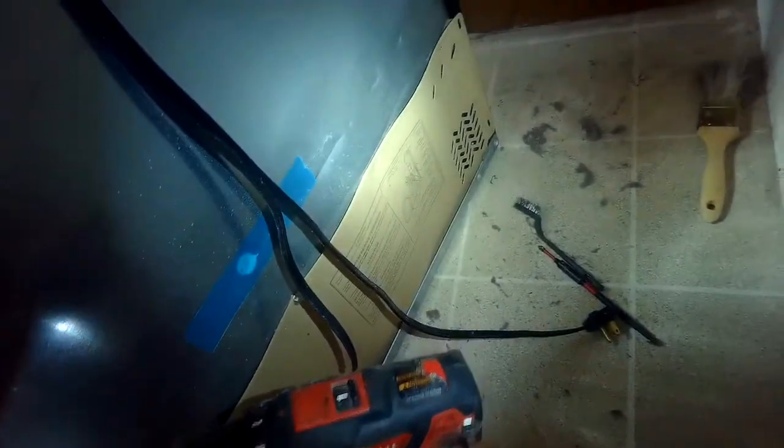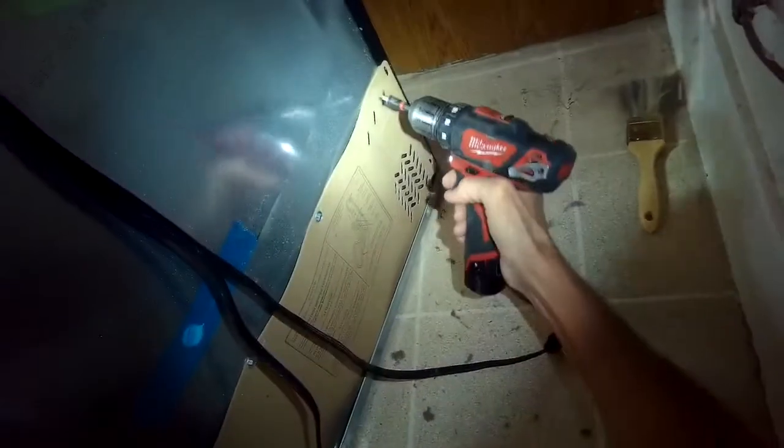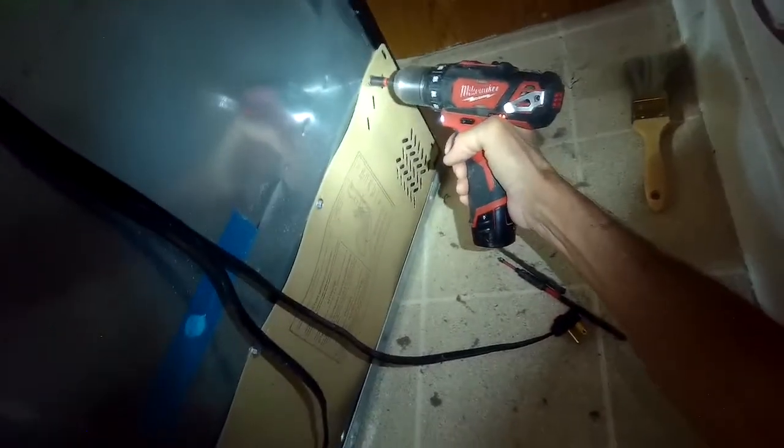What's really limiting airflow is just the dust that accumulates here in the back where we just cleaned, and also in the front. And you want to make those areas as clear as possible. So we're putting those screws back in, getting that tight, and then we're going to get all this dust out of this area. And I am going to keep about a 4-inch gap between the back of the refrigerator and the back wall, just to create a little bit better air circulation.